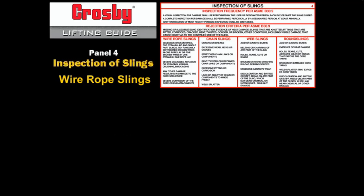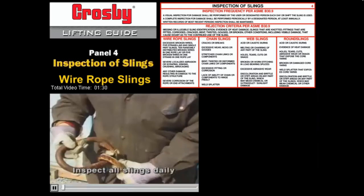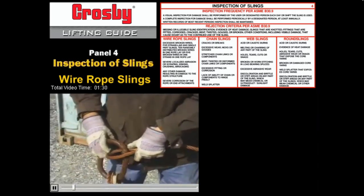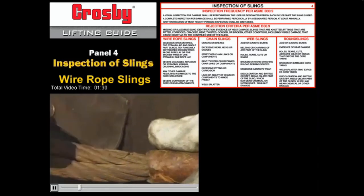The inspection of wire rope slings is usually a visual examination. This visual inspection requires a thorough understanding of what to look for. Inspect all slings daily and especially before any important lift. Look carefully for all the usual suspects: frayed, worn, and broken wires.